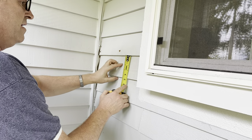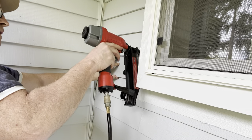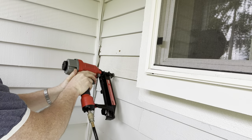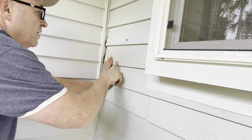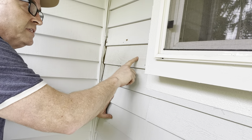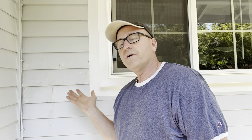All right, I think we're about good. So now all you'll do is just go back through it and caulk — fill in those gaps with caulk. We actually have some spare paint from when we had our house painted a couple years ago, so I'm just going to paint over this. There we go. I hope that was helpful. It might be a little bit different on your house — you might have vinyl siding, this is cedar siding — the siding might run a different way, but you get the general idea of what you're looking at in order to repair a hole in your siding. Thanks for watching and God bless you.